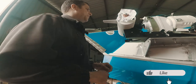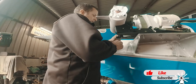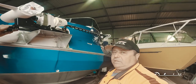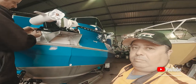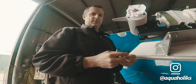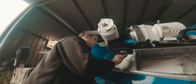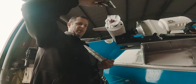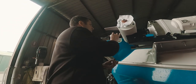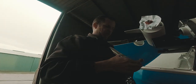If not, you'll need to pull that apart and grease it. The older types didn't get greased at the factory, so if you've got an older one it may pay to have a look at that and put a bit of grease on there — that'll help it when you're in the ocean. For cleaning, don't put anything on it, just wash it down with water. Everything is waterproof — it's obviously designed to get wet. Just wash the arm with water, make sure all the salt's off. Don't spray anything on there — no need to worry about it.